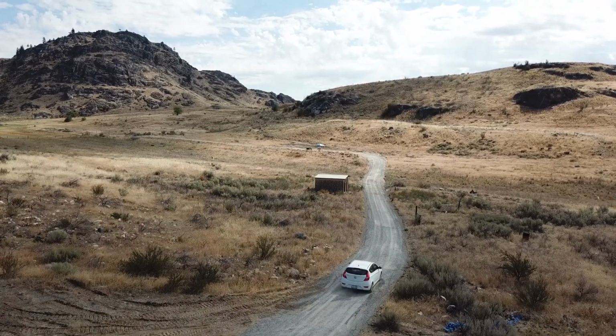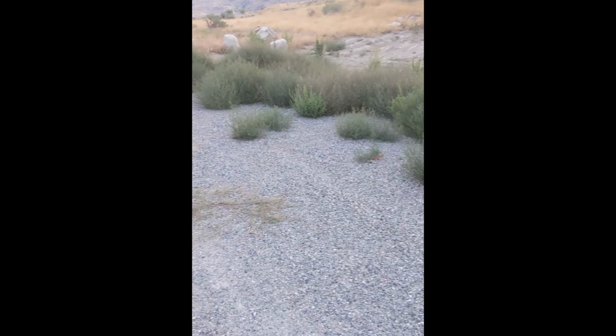The third mistake I made has to do with our road. When I had this thing built, I didn't request that they put down a barrier underneath the gravel layer. After just a few months of us not being out there, several plants have grown straight up through the road and the pad that was cleared for our building area. Luckily, most of them only have one deep taproot, which makes them somewhat easy to remove. However, this is just going to be an ongoing issue now that I wish I would have thought of beforehand.